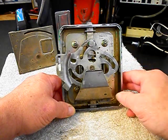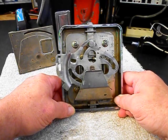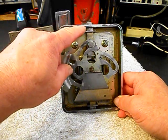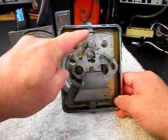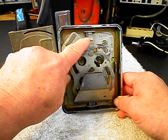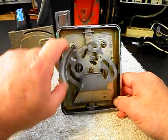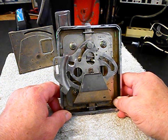This payphone is not going to be out in the public, so nobody's going to try to remove the door. And two deadbolts are enough to hold it into place and secure it just fine. So basically, we had to weld tabs of metal on each deadbolt so that they would not fall behind their guides and get locked up. So now that we have our locking mechanism working properly, we won't have any issue using the T-key. So we took care of that issue.